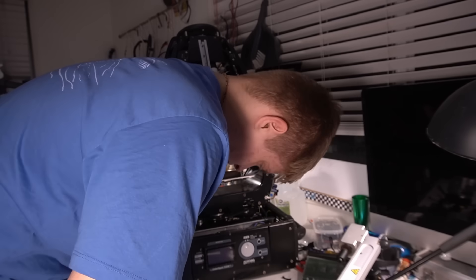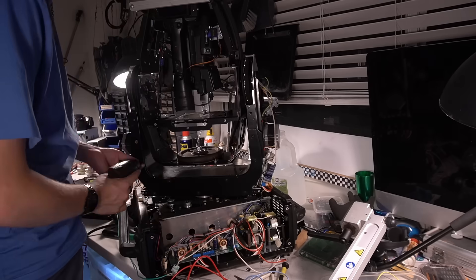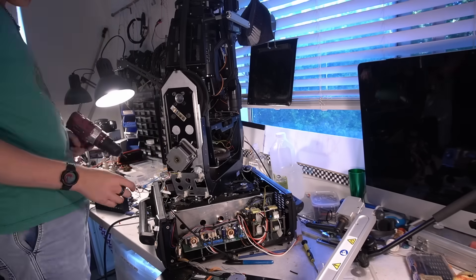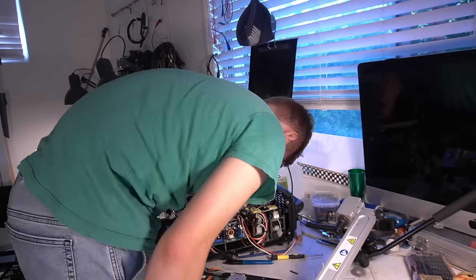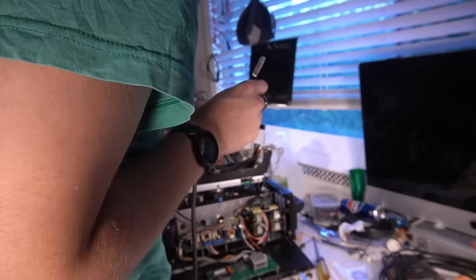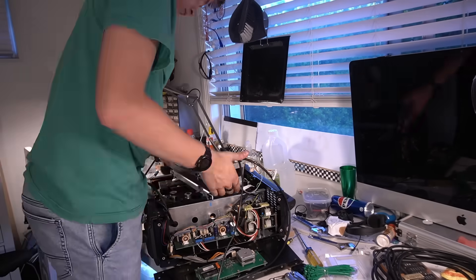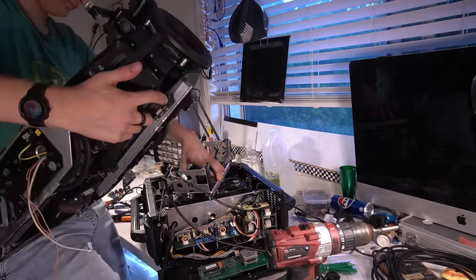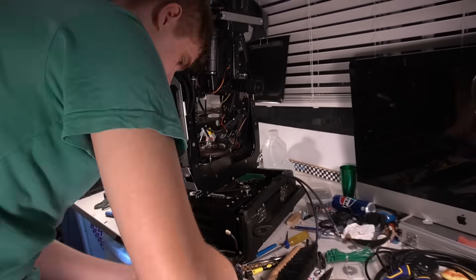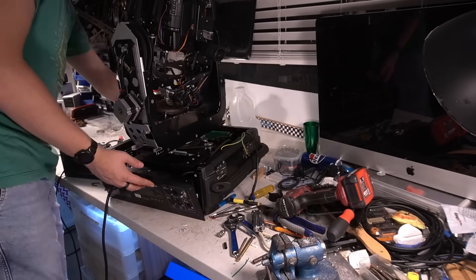With that now done, I've got to work on running cables. I took off a side panel and started disconnecting the wires I don't need after checking where they went with a multimeter. I then needed to take the head of the light off the body. I unscrewed a bunch of screws and labelled then disconnected the wires I would still need. After that, I very carefully lifted off the head of the light. I unscrewed the bottom of the yoke from the base and threaded through an SDI cable, DMX cable, and power cable. I then zip tied all the cables back up just how it was from the factory and put the light head back on the body. After putting it back together, I terminated both SDI ends and drilled a hole in the face plate for an SDI connector. I had to cut a chunk out of the heat sink to run the cable — the heat sink is for the lamp power supply which is no longer in use, so cutting it won't cause any problems.